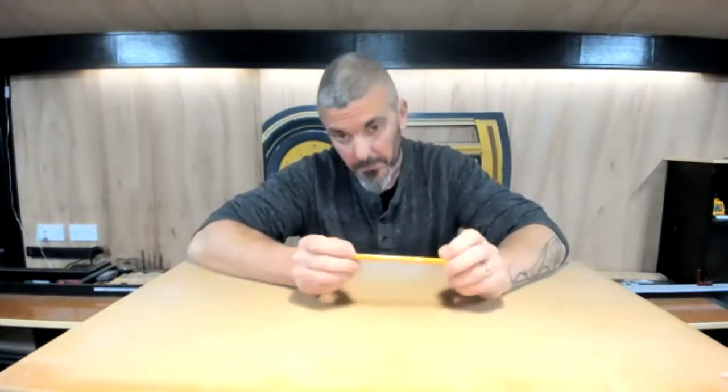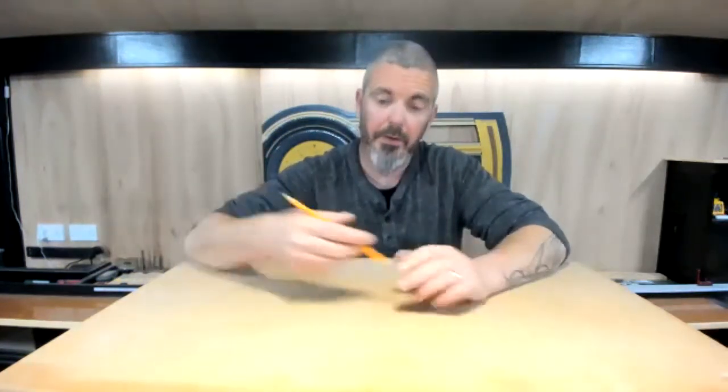Right. So then you have your oil and your water base. Sometimes, occasionally, you'll find yourself spraying as well. Now, I got a big extension built a few years ago, and I painted the whole thing on the inside in one day. I went to Aldi, paid 200 quid for a paint sprayer. You can rent them in some places, but they nearly cost you 100 quid a day. Went to Aldi, got my paint sprayer for 200 quid, and basically you get your normal emulsion paint, you put it in a bucket, you water it down a little bit, and there's a little gun with it, and you couldn't believe how easy it is to use.